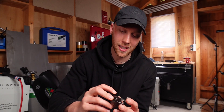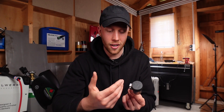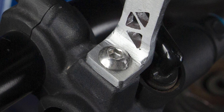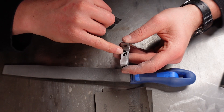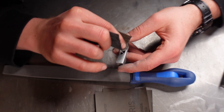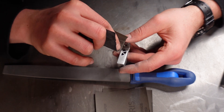Now on to the final tip from my good friend Drew. He noticed that hand files actually leave quite deep cuts into the material, and in some areas there are little marks or bumps that are still noticeable because the light reflects differently. Drew recommended to take some sanding paper and go over it with different grit sizes. Even if you have tiny areas that need special attention, try to work as big as possible — if you just focus on a tiny area, you create another little spot that needs special attention afterwards.